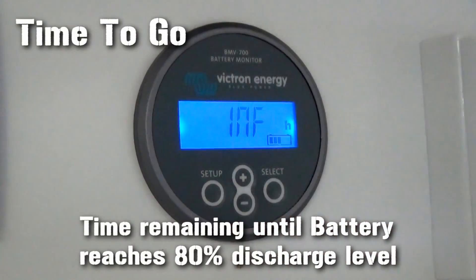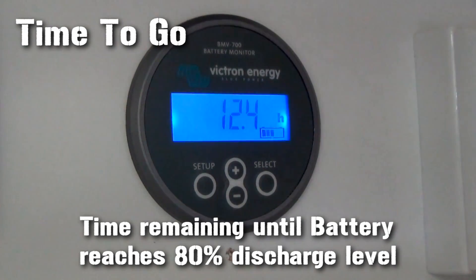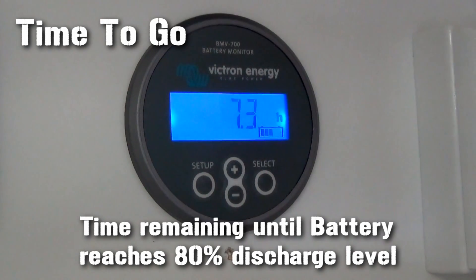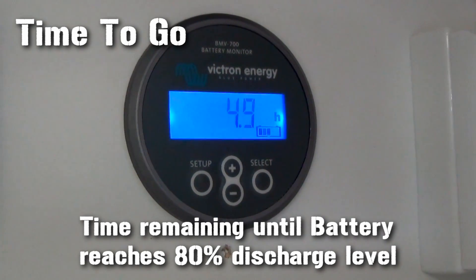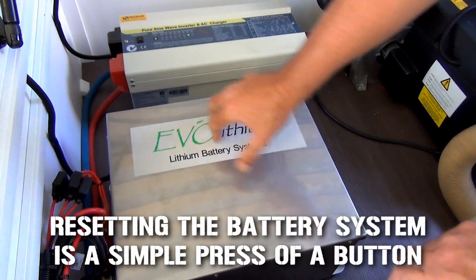This setting — if I run the microwave, every three minutes it checks to see what sort of load we have on the system and basically tells you how long it will run until the battery is discharged down 80%. It takes about three minutes to work it out. The battery monitor also has settings preset in it. Once it's discharged down to 70%, it has an alarm — the display flashes, letting you know you've consumed 70% of the battery. It will turn off once it's discharged a further 10%, down to 80% discharged. Then it's just a matter of resetting it at the front and charging it back up.